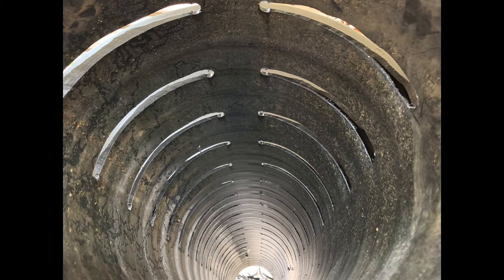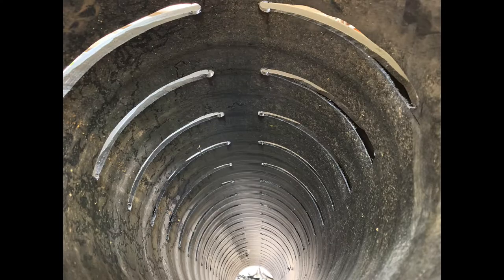The way that I cut these slots — you can kind of tell from the photo — it's rounded on the edges. I just took a half-inch spade bit, which is about as wide as one of the valleys in this corrugated pipe, and drilled holes in every other valley all the way down the pipe at 3 o'clock, 1 o'clock, 11 o'clock, and 9 o'clock. Those four holes created the guides for where the slots would go, and then I was able to fit a metal blade from a reciprocating saw to cut out the slots using those holes.